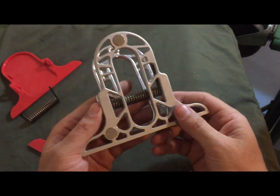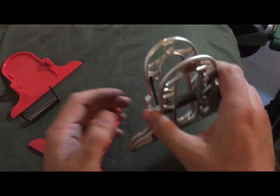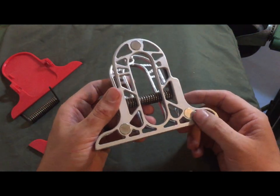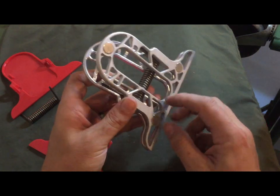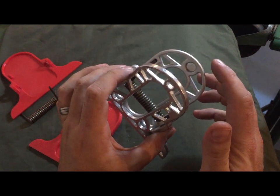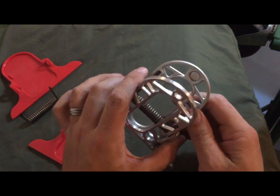And that would kind of help out with the whole bulky, heavy feel to it, so that you just hang it up instead of it sitting on a shelf or whatever and flopping over. So these magnets are neodymium magnets, and they're pressed in. It's a press fit that I'd machined out there. And originally I was thinking I'd have to glue them, but then I thought if I made it just the right fit, that it would fit well.